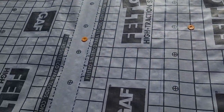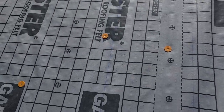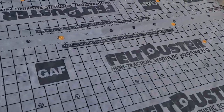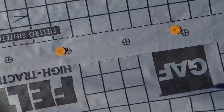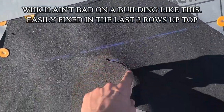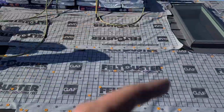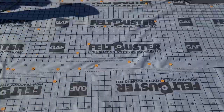All right, we got all these lines snapped — a little tough to see the light blue on the felt, but they're all there every other one. We're snapping the line for our starter now and we're ready to roll. We're about an inch off from the ridge on our top line. It's a bit weird — this one's about two and a half inches above the ridge but this other one is right on the point of the ridge. When we checked it from that ridge we're off only an inch, so that's not too bad.